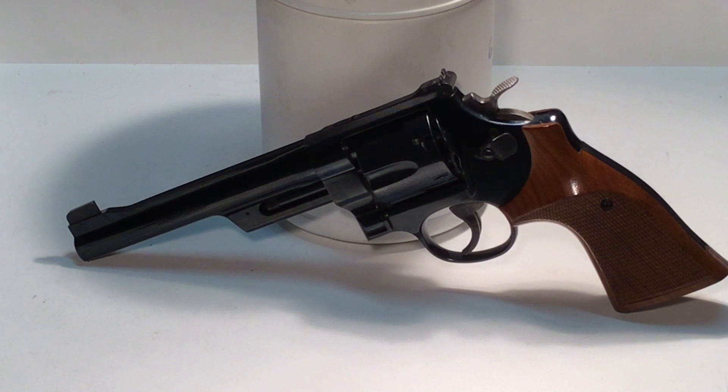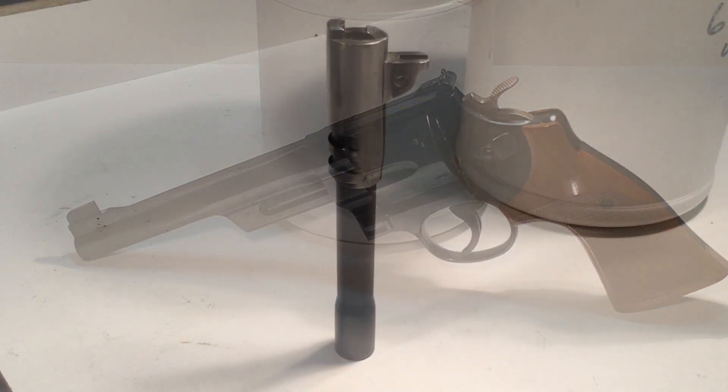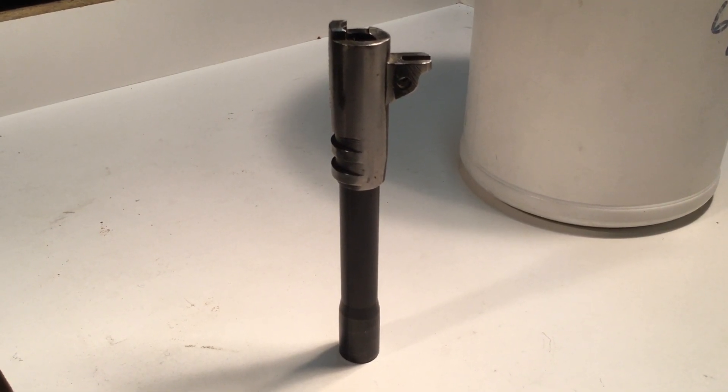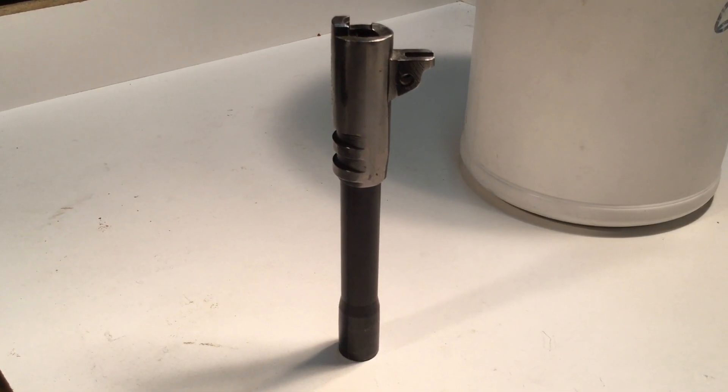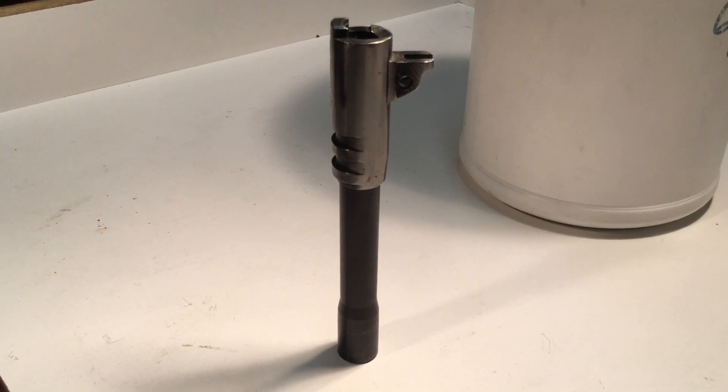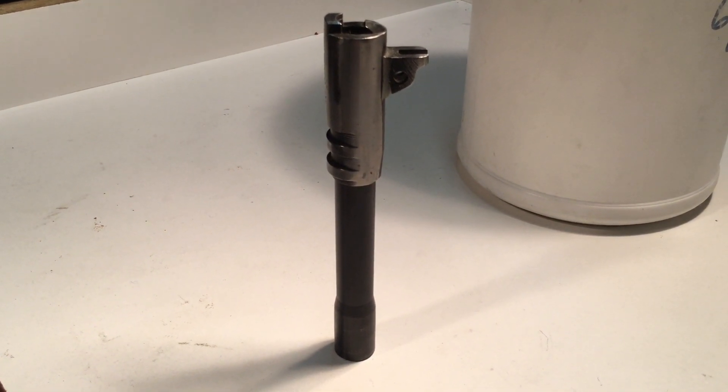However, if you measure the cylinder throat for this revolver you get 0.356, so you can use bullets that are 0.357 or 0.358 — and that's the measurement you want to use for your revolvers. If you have a five-groove auto pistol barrel, you can get that dimension using this same technique. Auto pistol barrels are different because the barrel is integral to the chamber, so the groove diameter is actually caliber specific — if you look down a .45 ACP barrel you will see a groove diameter of 0.451 or 0.452.